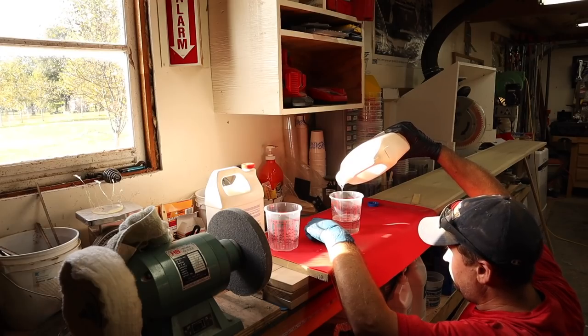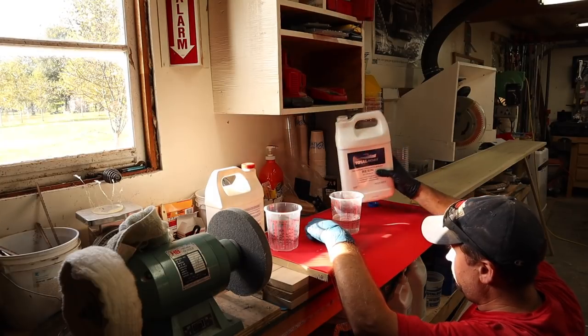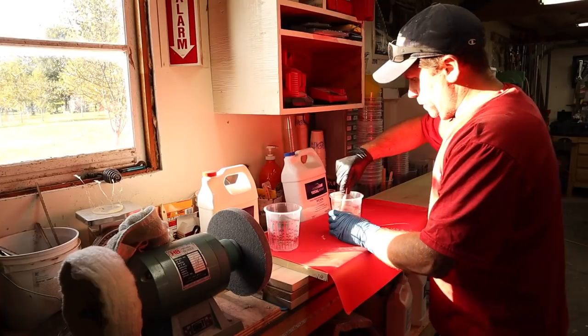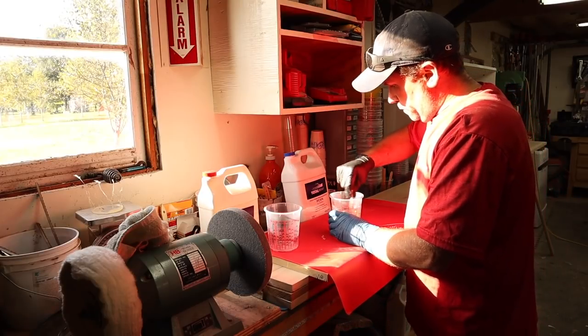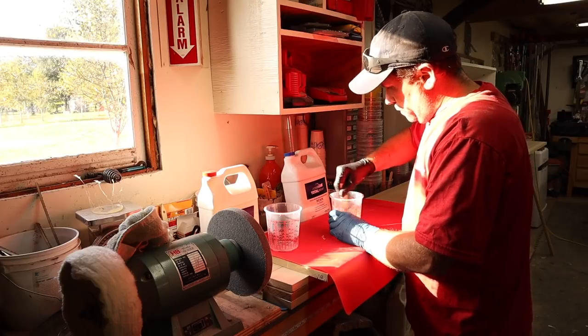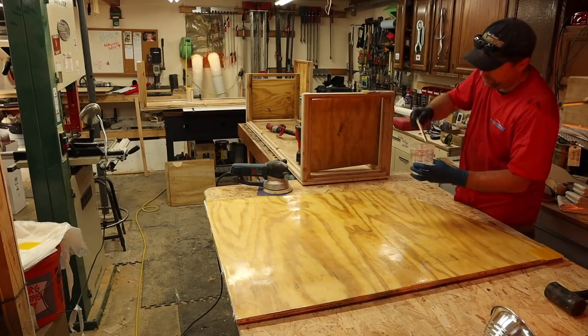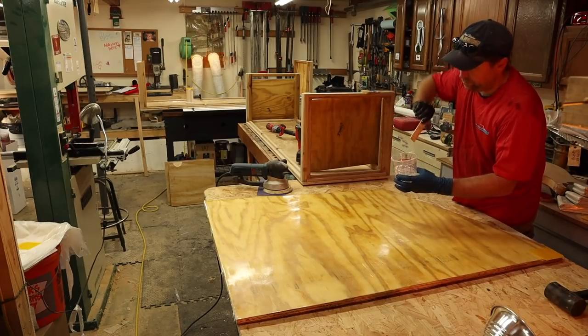We had a beautiful fall, and those warm temperatures allowed us to complete the epoxy laminations that make up our chine. That's fully installed now. It'll need a lot of shaping later, but the fact that it's in position means it will definitely be planking this winter. We also finished up our work on our diesel tank panels. They are all complete now, including the baffles.